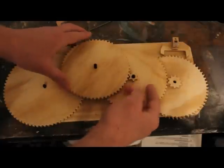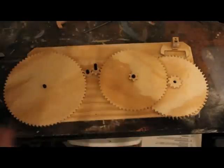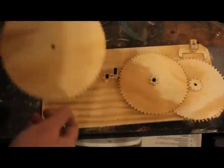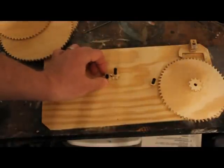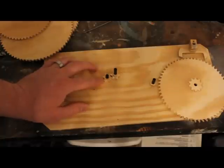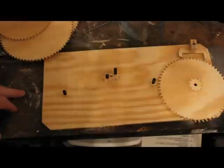The way it's set up, I think it'll be okay — the small gear will turn the big gear fine for the most part. But what causes an issue is when you have the two smaller gears together. If you take off this 72-tooth gear and the 60-tooth gear, you've got these two smaller gears together. The problem is it tries to turn but then they're just interfering with each other. So I'm going to have to figure out some solution — either widening it, narrowing it, or maybe actually doing some proper calculations — acting like a real engineer.